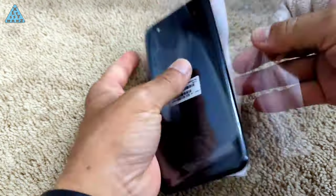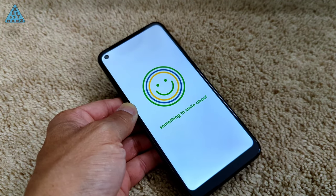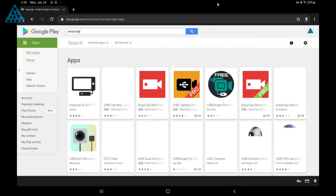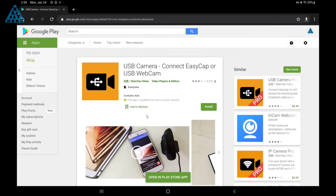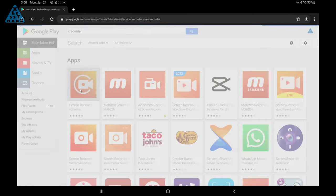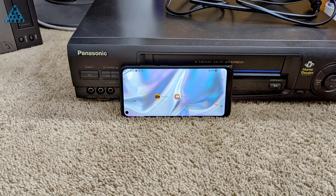I'm using one of my spare Galaxy A11 Android phones as the display. I'll set everything up off camera and give some details afterwards. I've installed both apps. When searching for the Yellow Icon app, I used the term EasyCap — there are multiple apps with the yellow icon listed, so select the one with the single camera that is not the pro version. For the other app, I searched for XRecorder; if results show apps where only the beginning of the name shows, look for InShot as the developer. To set up the phone, I did the following things listed on the screen.